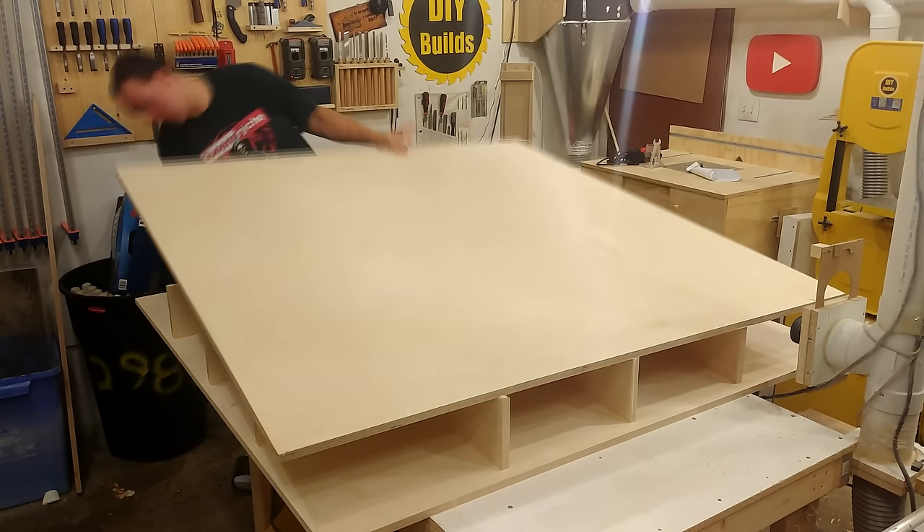I then test the fit to make sure everything is sliding freely and straight. I can then work on cutting a scrap piece of wood to hold the nut that slides up and down the acme thread. There's a little bit of a gap between the brass nut and the bottom of the wood — when I push the acme thread out to make the indent, I don't want it to sag, so that piece prevents that.